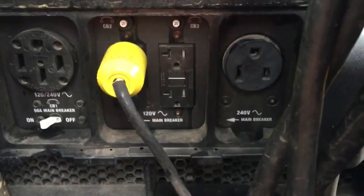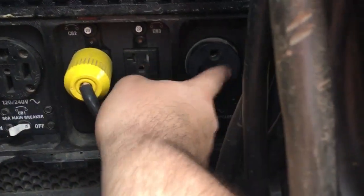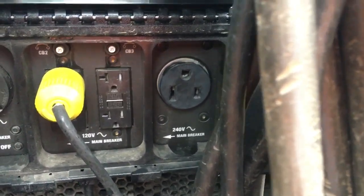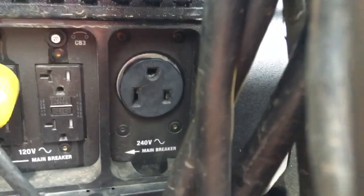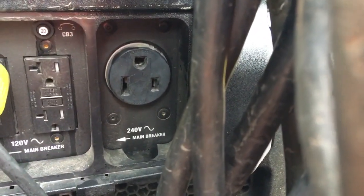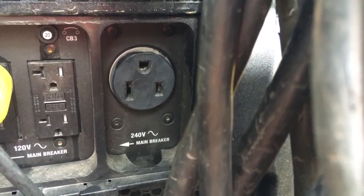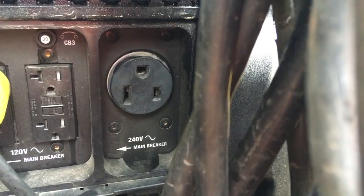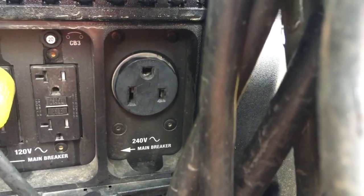One of the things I like about the Champion Elite over the Bobcat 250 and 225 is this right here: it has a plug to plug in another welding machine. This machine does not have constant voltage, so you can't wire-feed straight off the leads. But they were nice enough to put an actual 220V welder-style plug in here, so you can plug your MIG welder straight into it. I run my Millermatic 211 with the Spoolmate 150 spool gun off of this machine all the time.